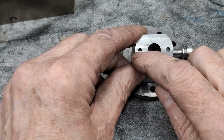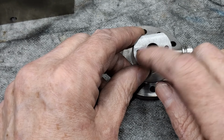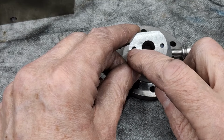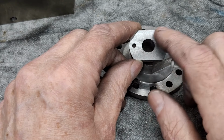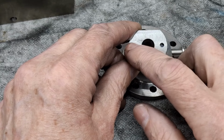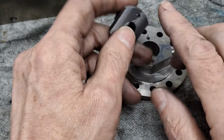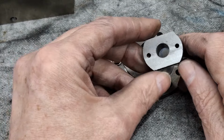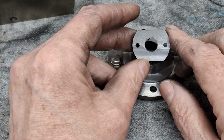I'm then also going to make an 8mm one with a 3.2 stub on it to work as the ends as well. So of course we'll be able to pop these in very carefully, draw around them, scribe a line, put it in the mill, whop the four corners off each one, and then just file out the corners round.